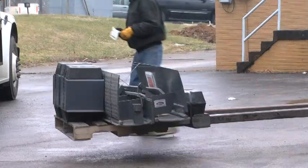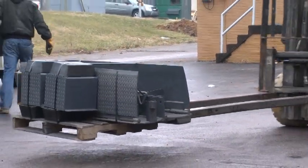The levelers are shipped banded without tension on the spring. Prior to installation, clean the dock face and area. Scrape the dock face, the vertical face of the dock, and the floor in order to make sure that there are no protrusions such as a bolt sticking out or excess concrete on either the floor or the face of the dock.